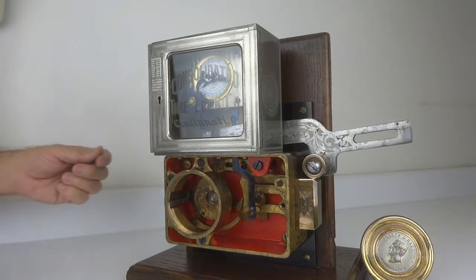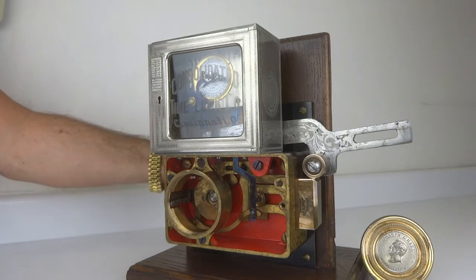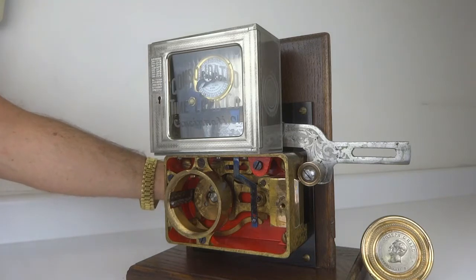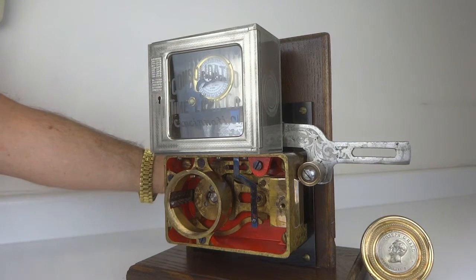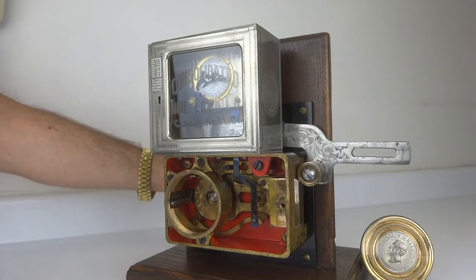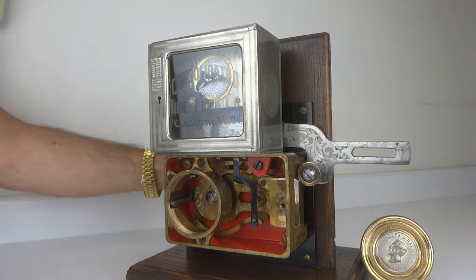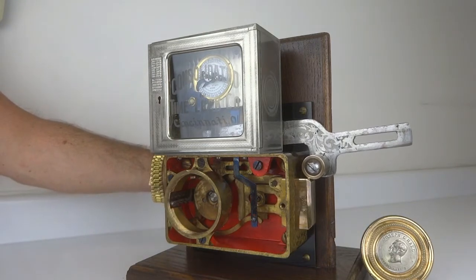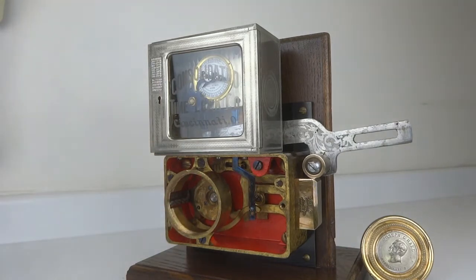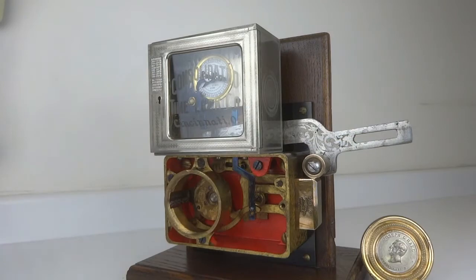One can see how this works by simulating the lock being opened thusly. So when the attachment falls, the bolt work is then released and the door can be opened. That can only happen in the event that the time lock is off guard and the correct combination has been dialed into the time lock. Once again, when the time lock is on guard and the door is closed, this then is raised upward into the locked position.